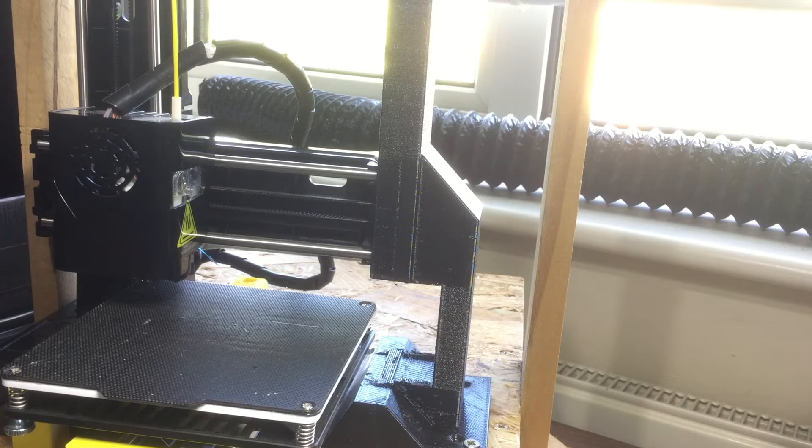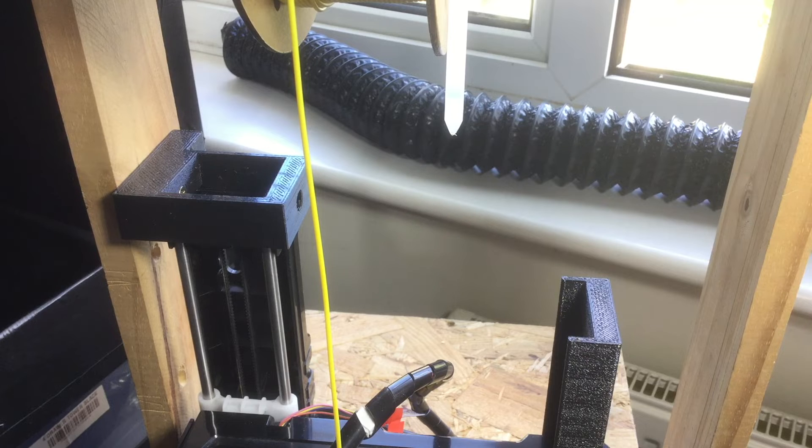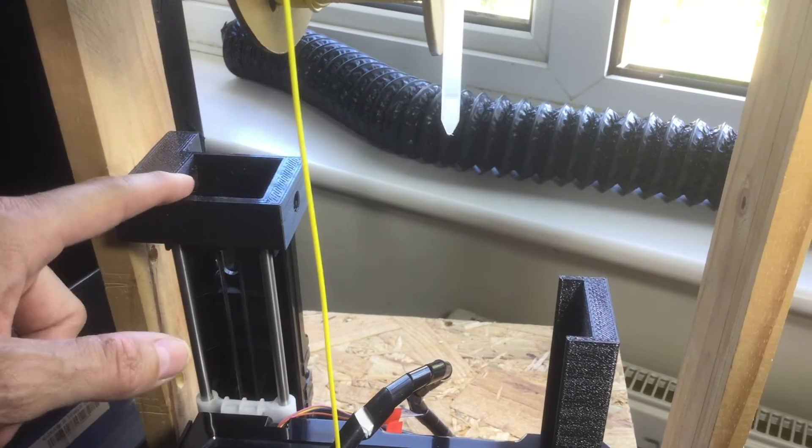Because you've got that extended vertical piece which has to be strong, maybe that could have been a tad thicker. But looking at it, it looks about 10 millimetres, so I'd be quite happy to go with that for PLA. Now I'll move on to the final piece in this tranche of models - that's the bracket for the Z-axis. It does stop twisting and obviously the side-to-side movements as well. That's very firm and very strong.